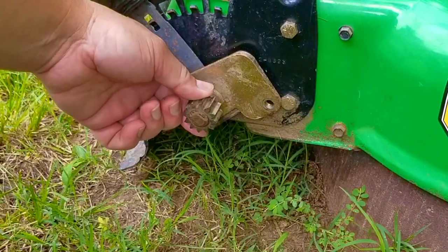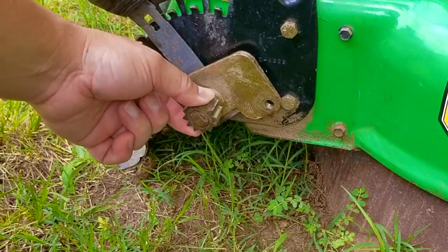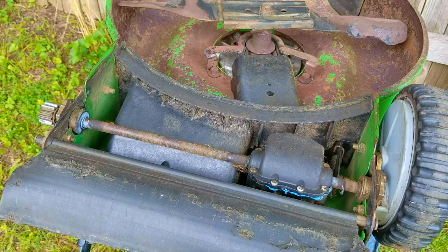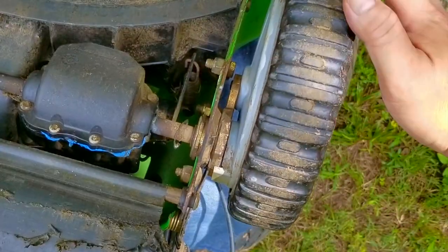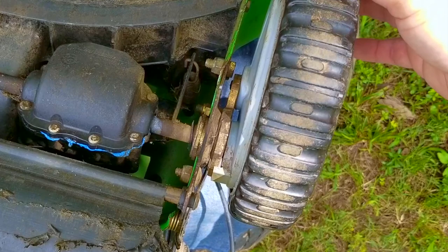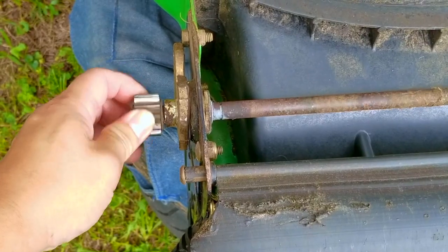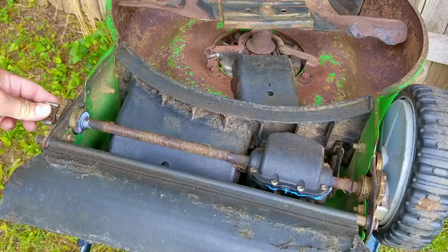After taking the right wheel off you can see it wasn't just the wheel that was stuck — it definitely has to do with the gearbox. With both axles visible we can try spinning the wheels to see how serious the issue really is. The axle on the right of the screen, which is really the left wheel, spins along with its axle. However the axle on the left of screen is locked up, so we need to remove the cover on the gearbox and find what's causing the issue.